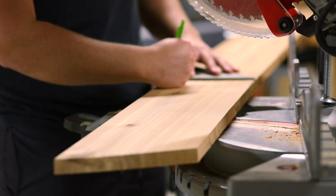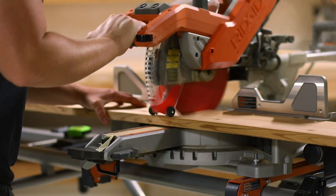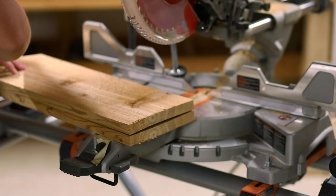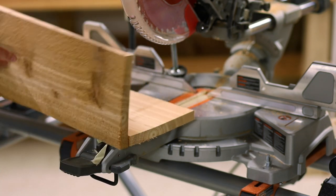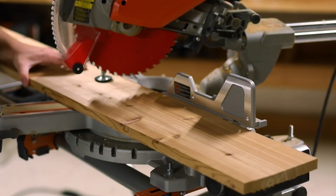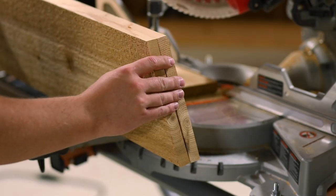After cutting the side panel's top edge I'm ready to measure and cut it to final size. This side piece does need to be tall — I went with a full two feet. Once the first side panel is cut it's quick and easy to trace its partner, no measurement necessary. This is where you can start to see that this cedar stock is quite warped. This is the perfect project to use this stuff up. Now I'm going to cut this one down and at this point we have our two opposing side panels.